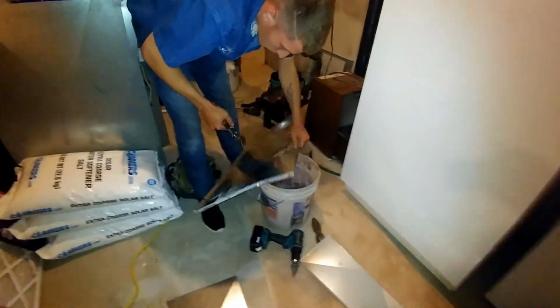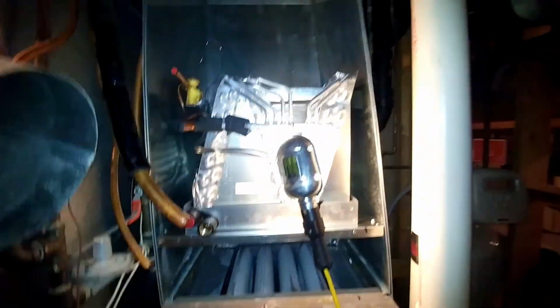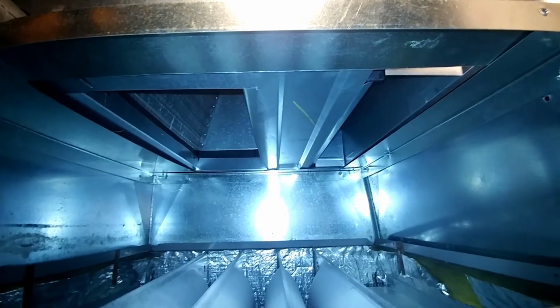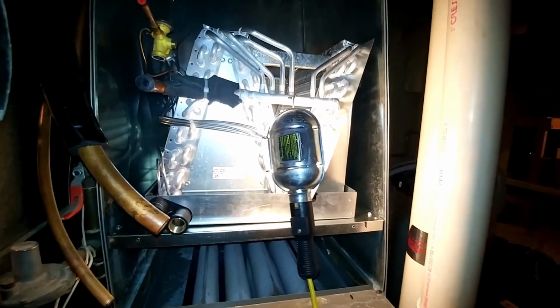I was in here giving them a little lesson. I'm bleeding in 4 places right now. Let me see this coil. Okay, we got this pitched to the front here. Oh, we're not blocking any of our airflow in the end coil here, which is a must. You gotta leave those 2 openings totally unobstructed. We got everything set back to where nothing's vibrating or touching on anything in here. Go ahead and put her together.